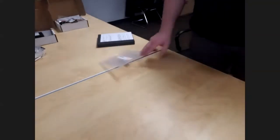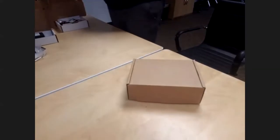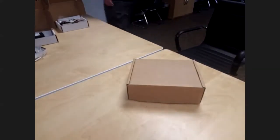There are two models of the EMS module. One is the SV-EMS-220, and that's what most people will use. But if you have a Rotax 912 iS, or I guess the new one, the 915 iS as well, that engine has an electronic CAN bus where it self-reports digitally, electronically, some of the parameters from the engine. And so that requires some different electronics that aren't in the original engine monitoring module.